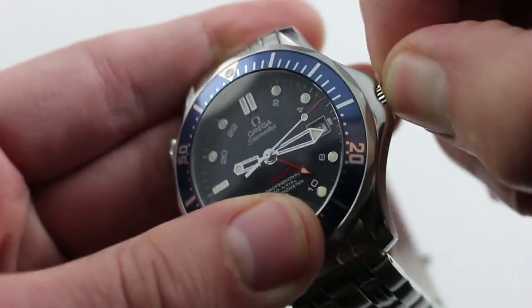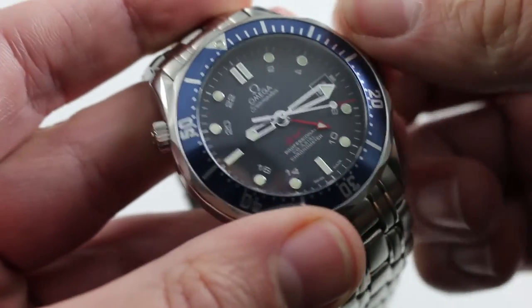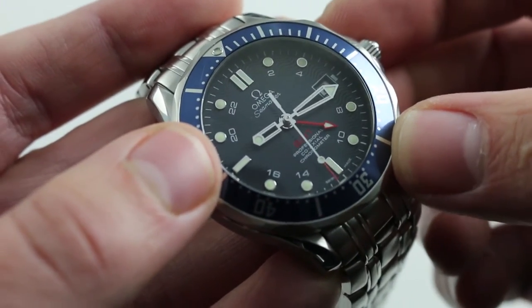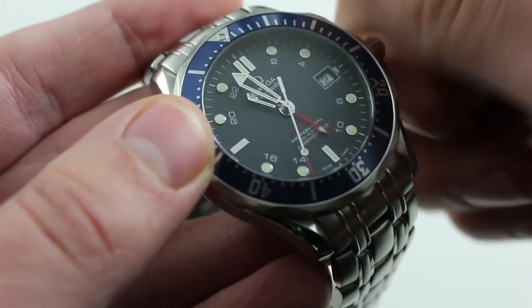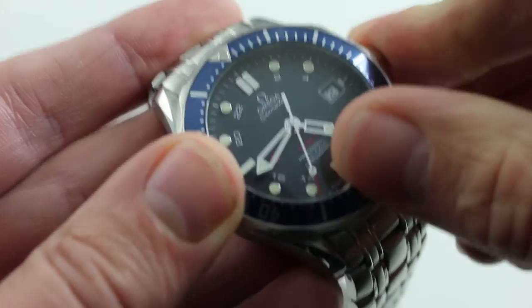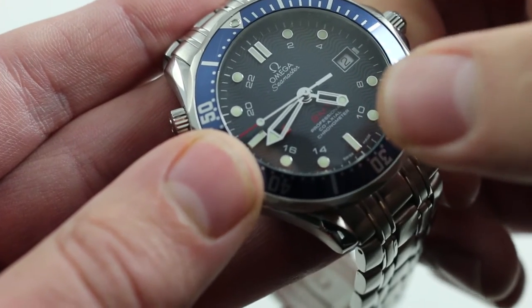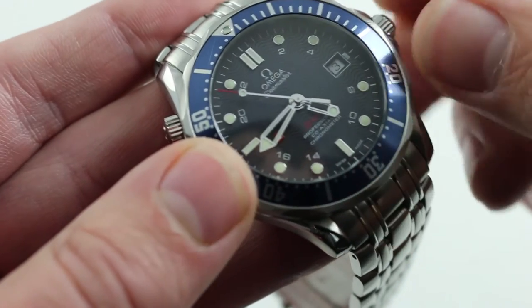Once I managed to remove this exceptionally resilient and broadly shielded crown, the interesting thing here is that unlike the 2892-based GMT calibers that preceded it — although this watch does trace its caliber 2628 far back to the original 2892 — it doesn't work like the 2892 dual times. Instead, it has hacking seconds and a system whereby you can move all hands in sync, but then, like the 8500 series and its GMT variants, there's a function that allows you to move the hour hand independently, whereas the 2893/2892-based GMT allows you to quick-set the second time zone and the date. In this case you advance the date by advancing the hour, but it's nice because you can set it forward and backwards as you travel.